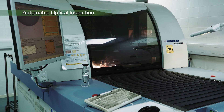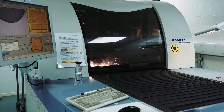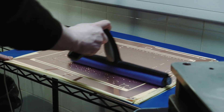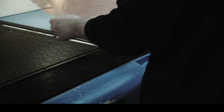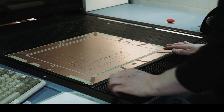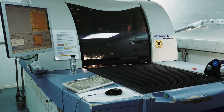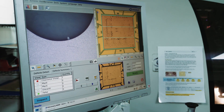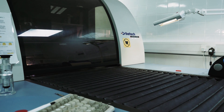The manufacturing data from the CAM is compared against the circuitry on the panel using the automated optical inspection machine. The panel is cleaned prior to scanning the layer. The AOI scans the circuit board and highlights any differences from the CAM data. Any discrepancies are checked by the operator and either repaired or discarded using the appropriate IPC rules.